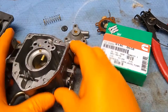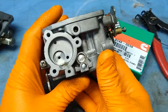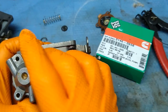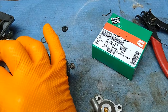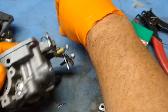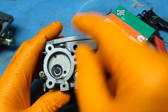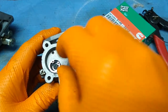This video covers a Nikki carb off an Onan engine that has an accelerator pump. It comes off with three screws, and when you take it off it has a spring and a plastic part — that plastic part is what actually goes bad. Anything plastic is susceptible to the fuel we have to deal with today, and a clip holds it in place.